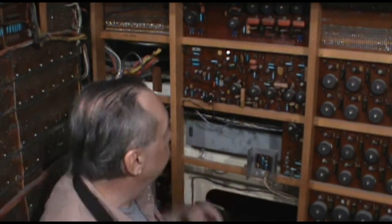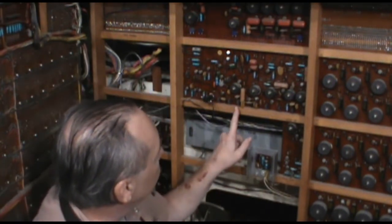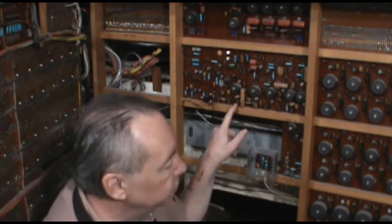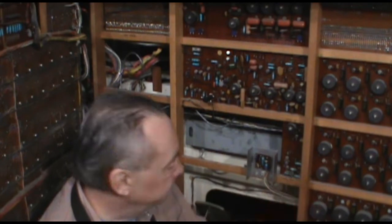From the main generator, which is on this other panel, we have the piano circuit, and it has a special percussion keyer that creates the piano tone off of those main oscillators, and then routes that tone over to here, where it joins the bus that goes over to the left-hand main channel.